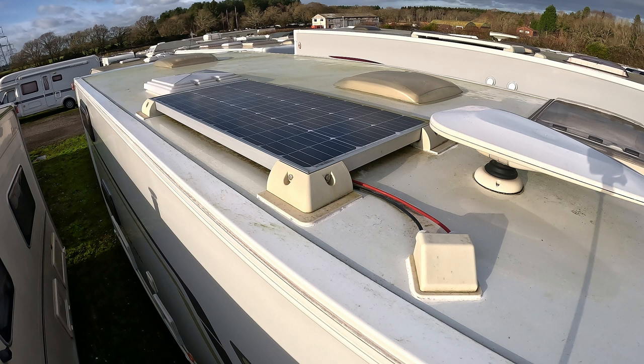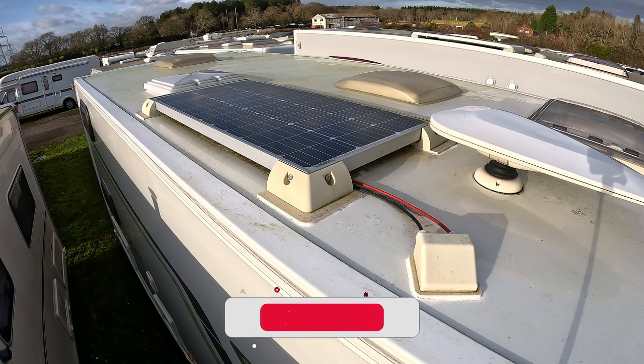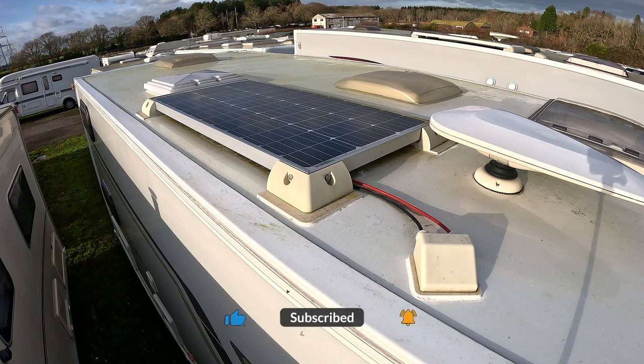You also have clear access here to see how the mounting kit works. There are four mounting points, and each mounting point has two bolts. From what I remember, the panel doesn't have these pre-drilled, so this is something you need to do. It's aluminium, so it's quite straightforward to drill through once they're in place. You can just put them in place, mark them with a pen, drill through, and then attach the bolts.